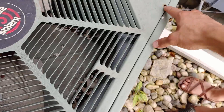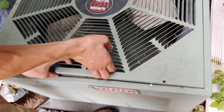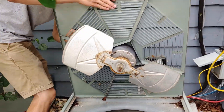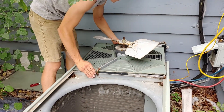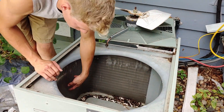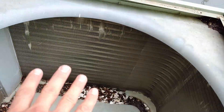I think the best way to do this is to just take out these two screws here, then lift the fan out — like this — if you're mindful of the wires. Just set the fan like that, leaning here so it's not going to twist or torque those wires in a bad way. We could take off all of these shrouds, but we're going to spray it from the inside. Since this fan is pulling air up this way, all the stuff gets stuck on the outside, so if we spray it backwards we should be able to rinse all that off.